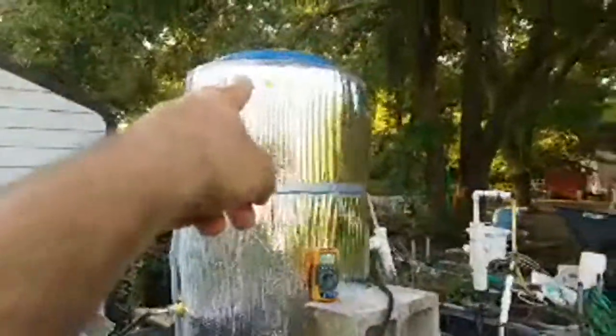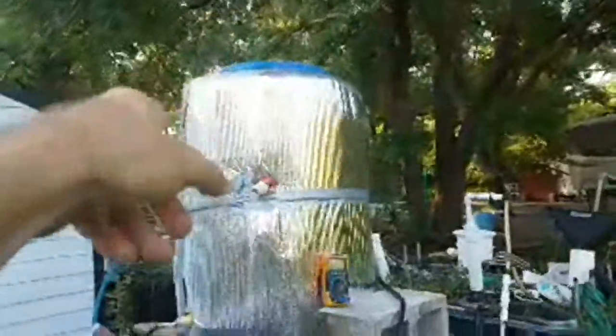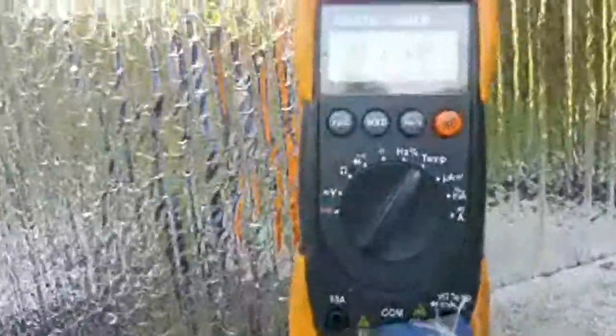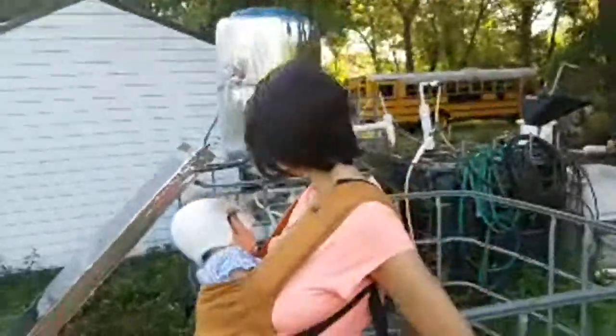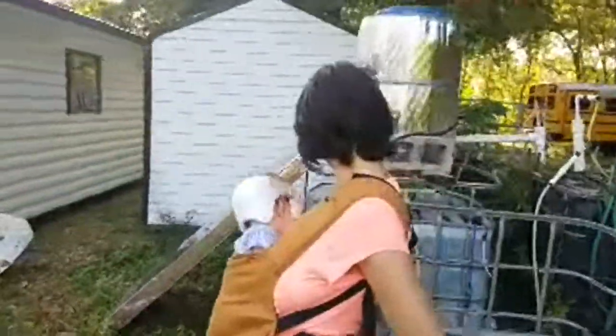and a barrel, an open barrel with a screw lid with styrofoam insulation around it, and a toilet float valve at the top gives you, over 2 days of sunlight, up to 124 at the very top, 119, but very hot water, which is useful for doing babies' cloth diapers if you, like us, do not want to ever use plastic diapers, because we don't want anything to go to landfill.